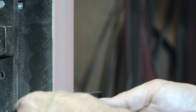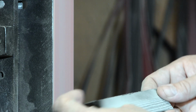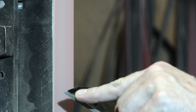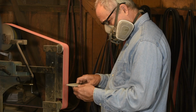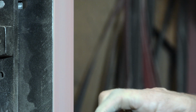So I break it down to, here's knife number one, it's dead straight. I'll grind that all the way out, just going straight out, cutting on into that second section of the blade. Now here's knife two, slight positive curvature. I'll switch over to that once I've got the previous section laid in, and then I'll grind that section.